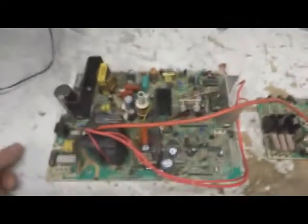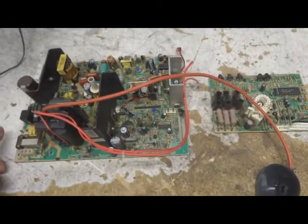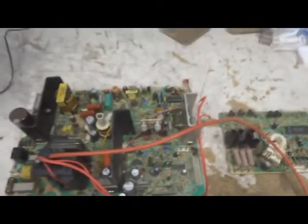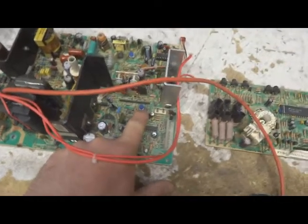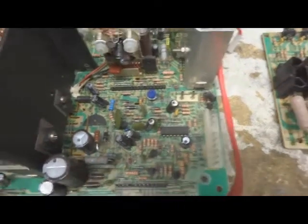Today what we're going to talk about, this is a tech series on how to adjust the 7475, specifically the Wells Gardner chassis. This should also apply to the U2000 and U5000 with one exception. The big exception between the two is the subcontrast pot. The 74 and the 75 both have a subcontrast pot, where the U5000 and the U2000 do not.